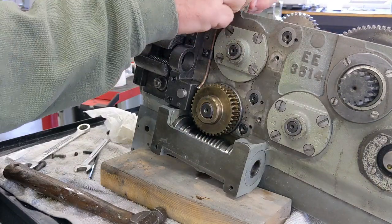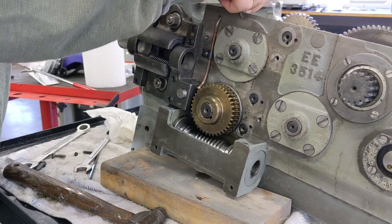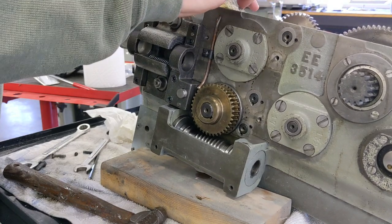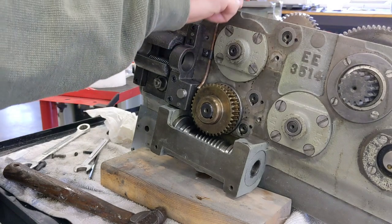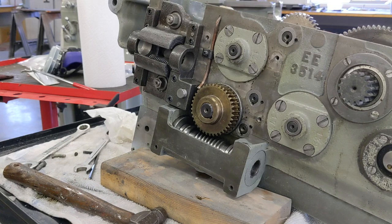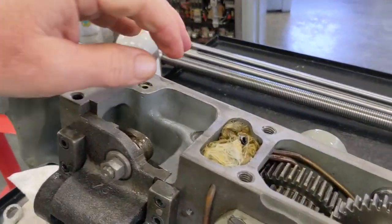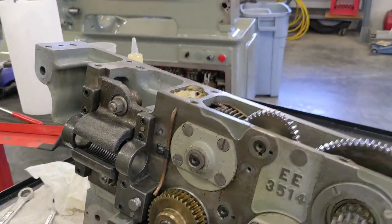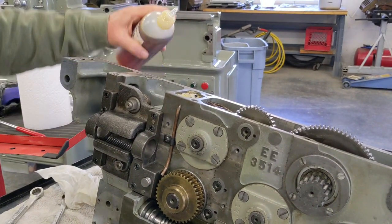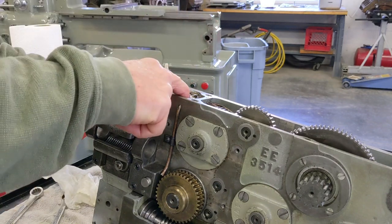This is that wad of material that was underneath here, so we'll put this back in. I want to get all the fibers down below because I don't want them getting squished in between the saddle and this apron. This is what I'm talking about right here — I stuff that back in there. I'm going to soak that up with some way oil so that it's kind of pre-primed. We'll just get some in there and get it all tucked down in there nice.